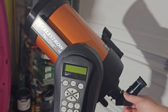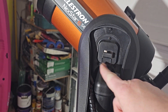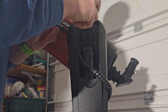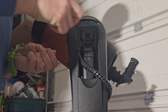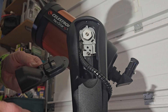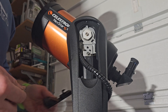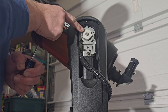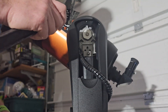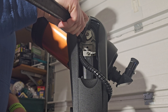It's pretty easy to adjust this tension. The way you do that is remove your hand controller, just set that aside, and then we're going to remove these three set screws. Just remove the three Phillips screws, and then the plate just lifts off — there aren't really any clips or anything holding it. Then all we really have to do is adjust this big nut right here. I've got my trusty adjustable wrench — you could probably use some pliers — I don't think it's going to be too tough to budge, so I've adjusted it to the right size.